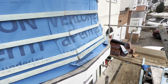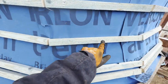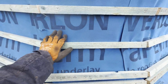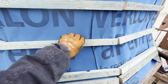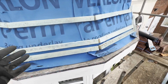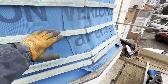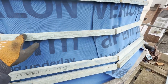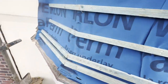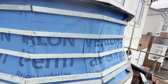Rather than it being awkward, I'll leave the top one for now. I've put two nails in each fixing point because there's only two pieces of timber on each side that I can fix the battens to. When I was stripping it, I was actually pulling the whole batten off as well when I pulled the tiles off, because I think the weight of the tiles was putting a bit of stress on the fixings. So I've put a couple of nails in each one just to give it a bit of extra strength.